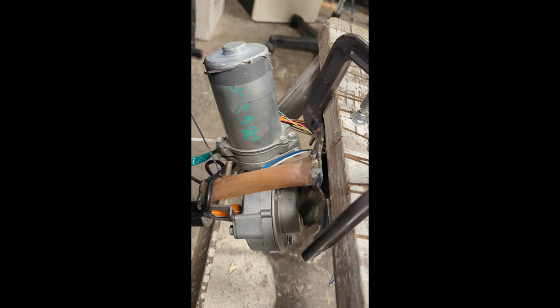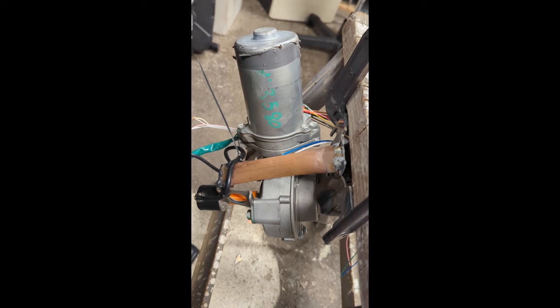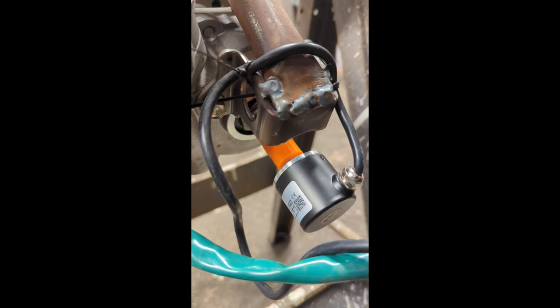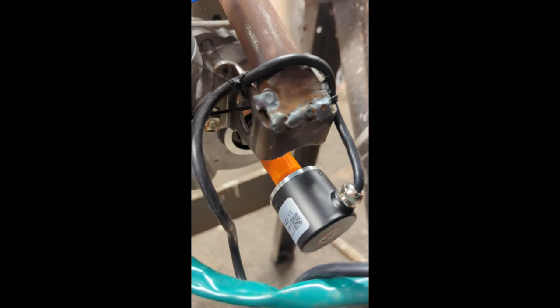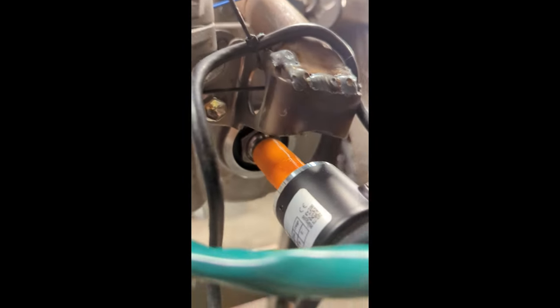It's a little DC brushed motor hooked up to a gearbox — I don't even know what's in there, it's fine. This is my encoder. I'm working with what I got; it's the best I have. At the moment I could do better, but I don't care to because I'm just testing it. I've gone and zip tied it on here and printed some stuff out of TPU. There's a spline that comes out of the back of this motor and that just goes down to the encoder.